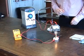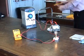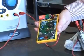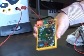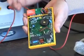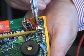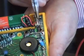Let's take a quick look at how the multimeter itself works internally. When you take the back off a multimeter, there are two distinct fuses. This one is the milliamp fuse — it has a very tiny wire inside. If the current goes above 100 milliamps, that wire will break, and you won't be able to use your milliamp circuitry unless you replace the fuse.